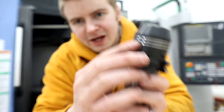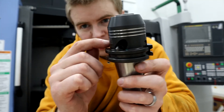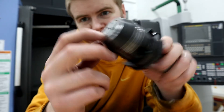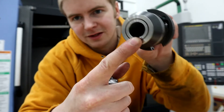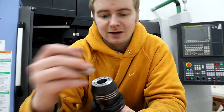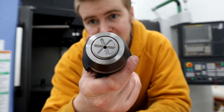There's hydraulic fluid inside of here, and when this plunger gets depressed the fluid is forced — whatever pressure builds up — into this sleeve here on the inside. It actually collapses and pinches the sleeve and the end mill that's in there.